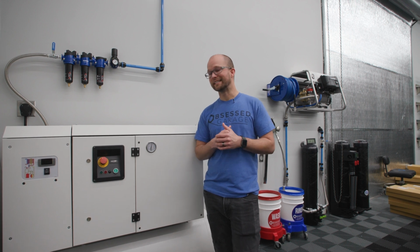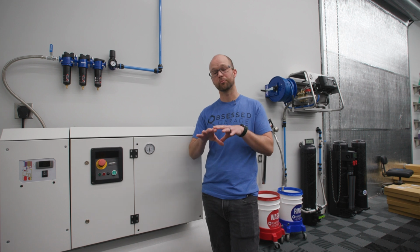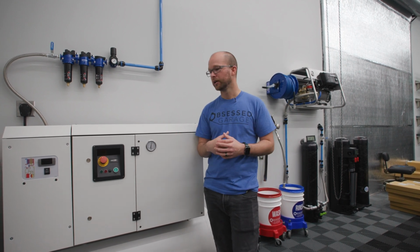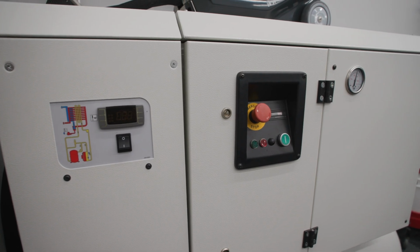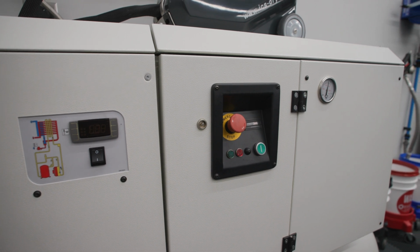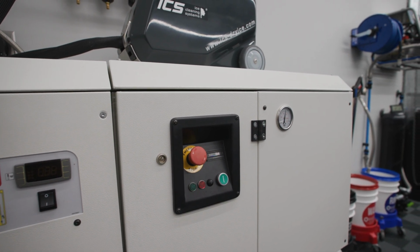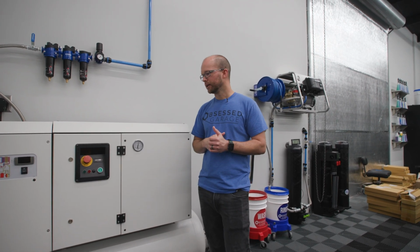If you're a detail shop and you're still doing those basic tasks, but you need to be able to support more users and more reels over a larger area, the 5.5 horsepower SCS from FIAC is probably a good choice, or maybe one of the smaller Jennies, like a 2 or 3 horsepower. Something in the 30 to 60 gallon range would probably be just fine.